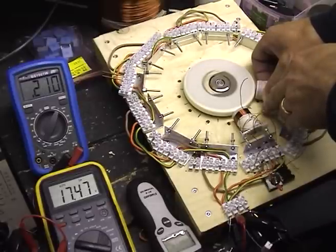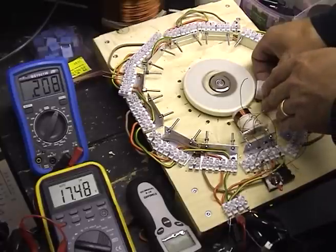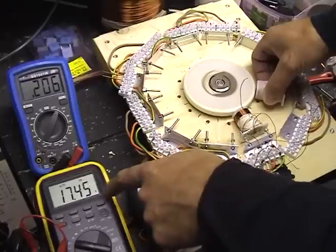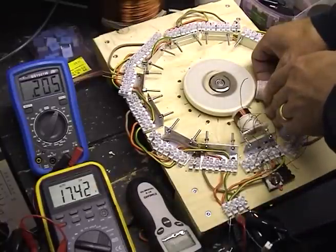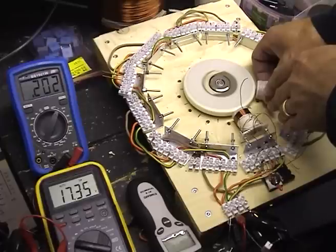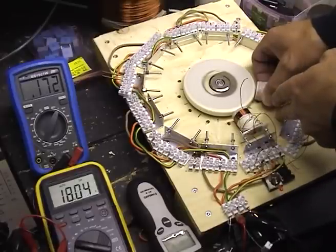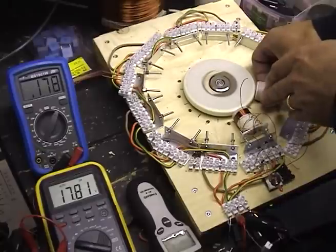I think this is as quick as it can go. If I move the trigger coil further, it will start to brake instead. And if I move it away, this voltage will drop — but it's going quicker. So there's a trade-off. Now we're quite near — it was too near, I think. You get the picture. Now I'm moving back again, and it's going slower. Now I'm advancing again.